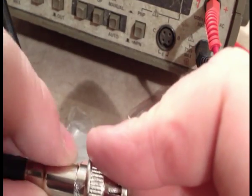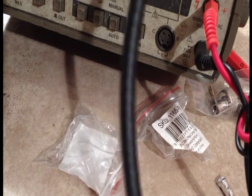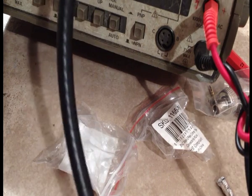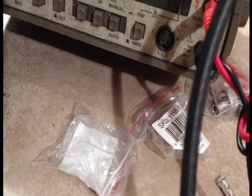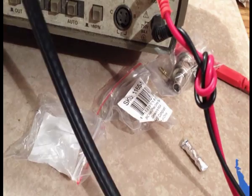Unlike some of the early connectors, you will notice that this one has a reducer ring, unlike the other ones I have, which don't. So you've got some options here with this one. So I'm going to take the smaller crimp tool, which is designed for... Okay, see how that looks so far? And you get a nice hex crimp. And that's not attached up here. So this part here, unless I can totally crimp this part, is still loose as a goose. You can't do anything with this. If you put it on something now, it's going to come off. So I'm going to crimp it.